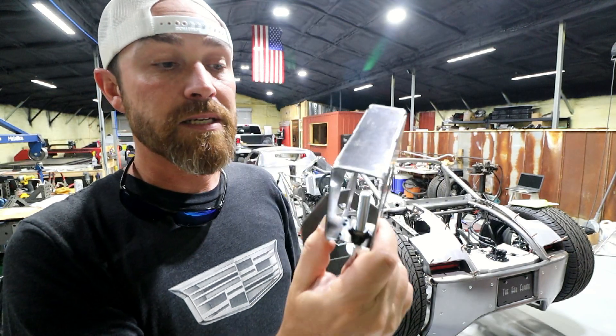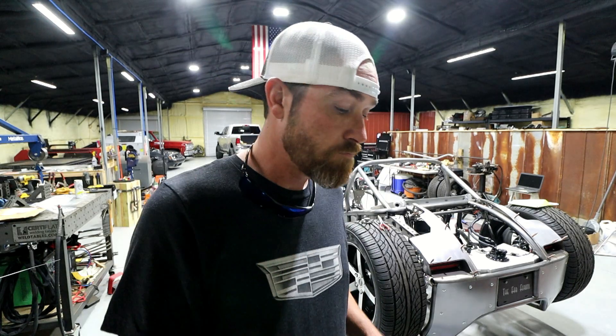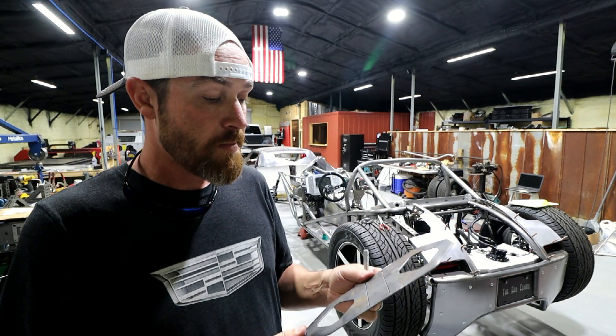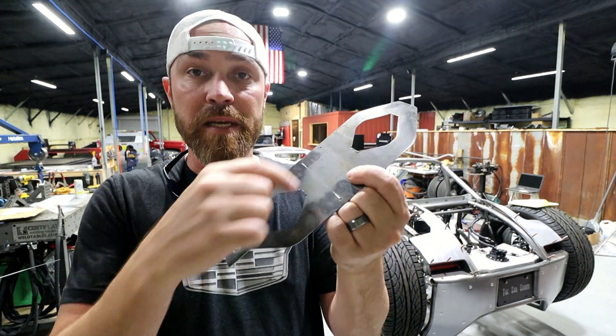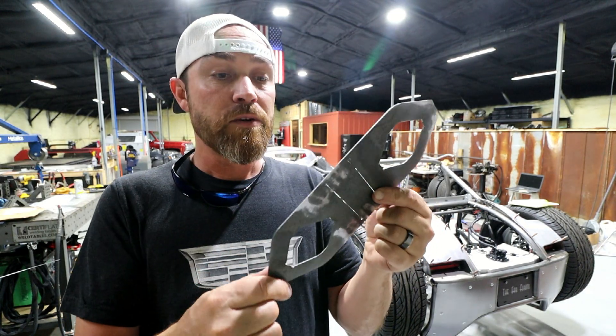Kind of like you see right there — that's been welded and just ground off. What I like to do is in the relief cuts themselves, put some tacks just to hold it where it's at. You can grind those flush so it's nice and clean, and then you can either paint it or seal it. All you need is a welder — everything else is designed to be bent by hand. Now, these parts come right off the table so they may need to be cleaned up a little bit. You can knock off some of the slag or grind it off, whatever you prefer.